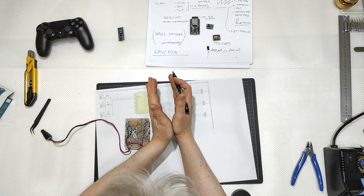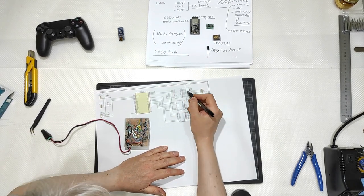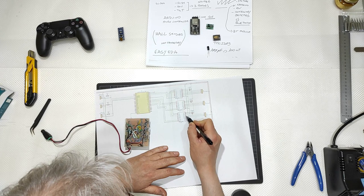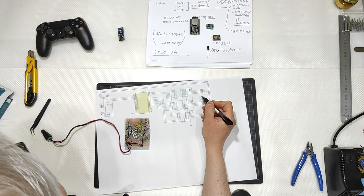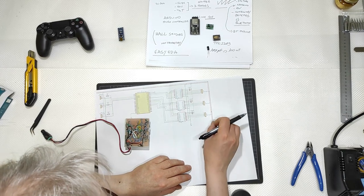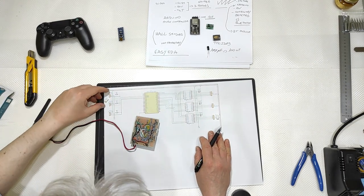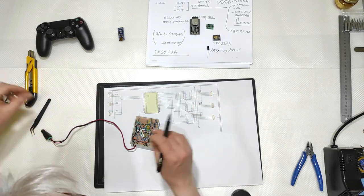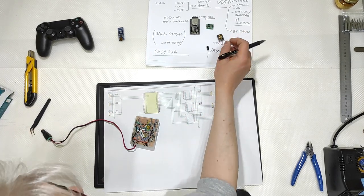Once this section was wired, I went for the right side of the stepper drivers, connecting the stepper drivers to the capacitors and then connecting the pins of the stepper drivers to the connectors. Those are the four pin connectors. Those ones, they are similar, okay? It is a connector with 4 pins. The other side, for the hall sensor, is a 3-pin connector like that. Almost the same dimension as you can see. Even the stepper driver one is a little bigger, but the others are similar, okay?